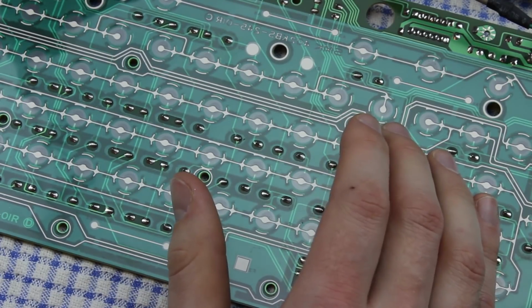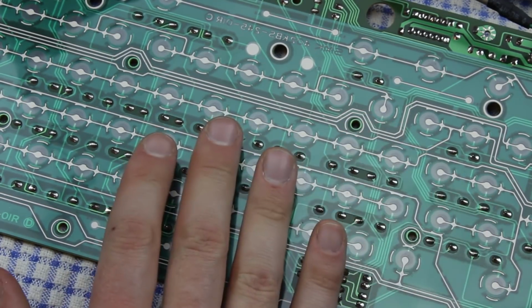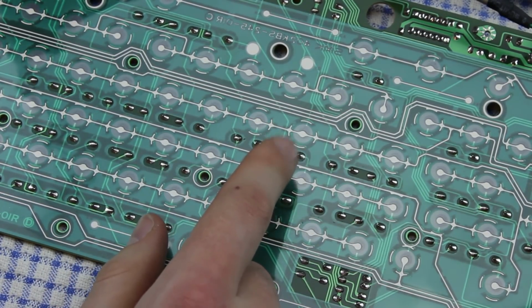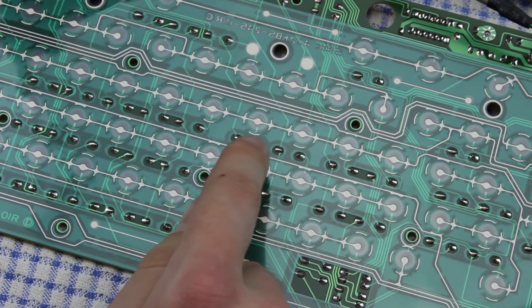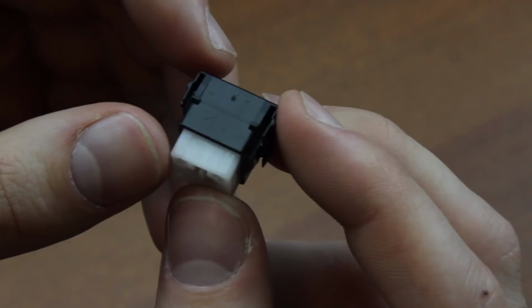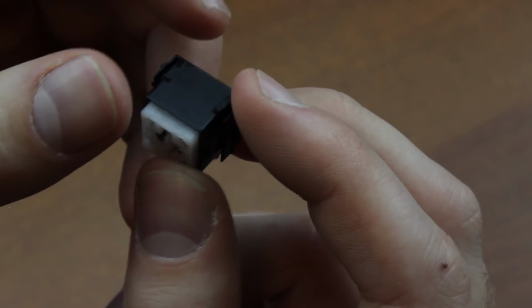And the reason it has no conductive pads quickly becomes clear if you look at the PCB, which has a membrane sheet on top of it. So instead of working on the PCB directly, the domes push the membrane onto the PCB, much like a normal rubber dome keyboard. Funny thing is, when playing around with a discrete switch like this, it actually feels really good.